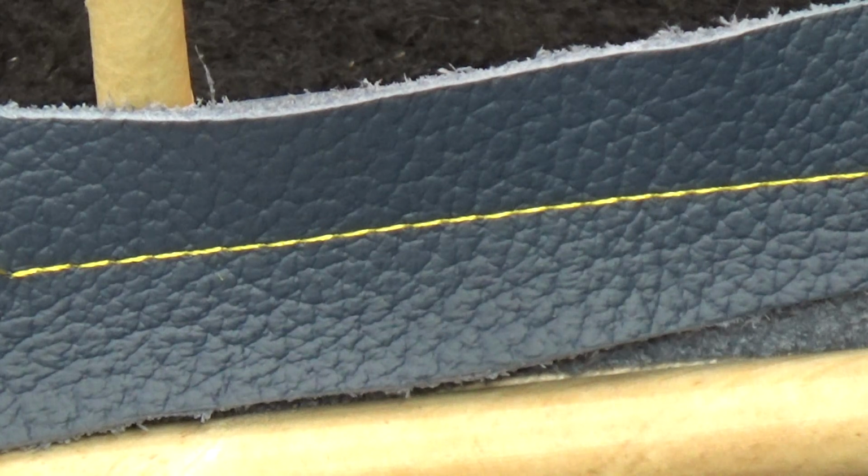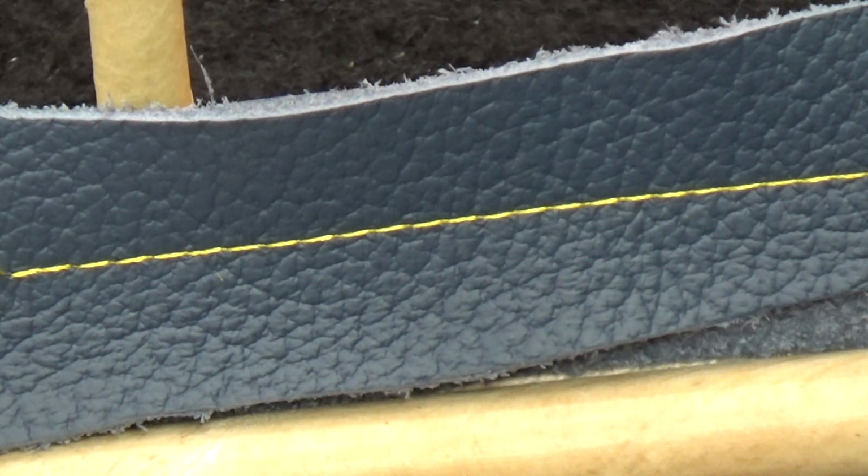I'm going to declare that a page 34 with the understanding that if we were going to sew a ton of this, what are we going to do? Type it in the chat. What are we going to do if we're going to sew a ton of this protected full grain leather? 2 layers of it, about 6 to 8 ounces of leather. What are we going to do to make this lock stitch more poppy? We know what to do, and we can do it very easily. So if you typed in the chat, we need to bump up our upper tension so that it's going to define that lock stitch more.